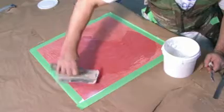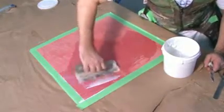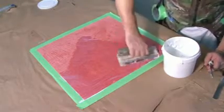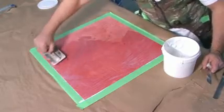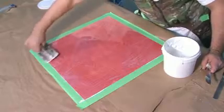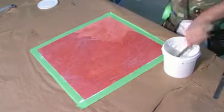Traditionally, lime Venetian plasters are sealed with different waxes and then polished to a high gloss. Here we are using our Duragloss as a sealer. Duragloss is an acrylic wax that does not remove with detergent applications, and unlike wax, can be painted if necessary. The best method for polishing Duragloss is with a commercial polisher and a D500 polishing pad.